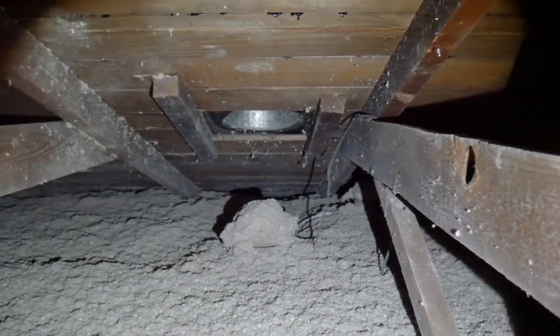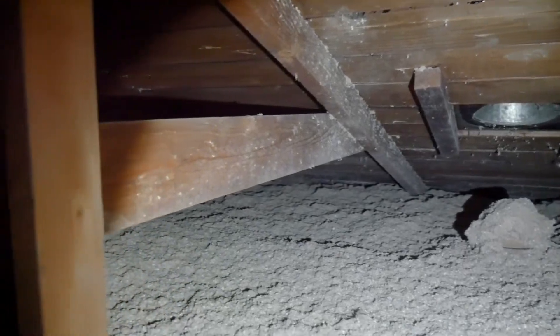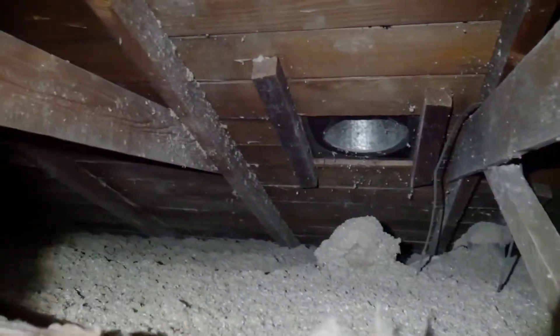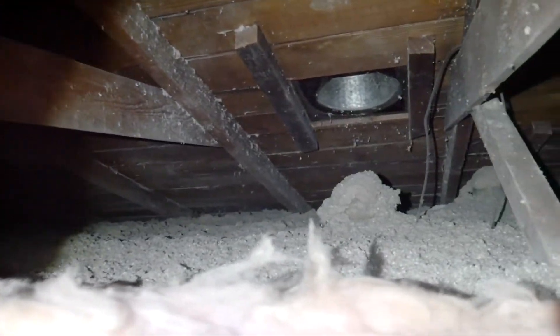The light colored roof reflects sunlight and helps keep the house cool. Below that roof is our new R44 insulation which is doing a great job. In order to install the insulation we upgraded the knob and tube wiring, removed the old insulation, cleaned out any debris, and then blew in the new material. Blue Rock Home handled the cleanup and the blow-in and did a great job.